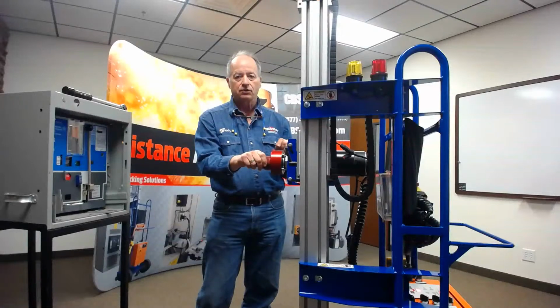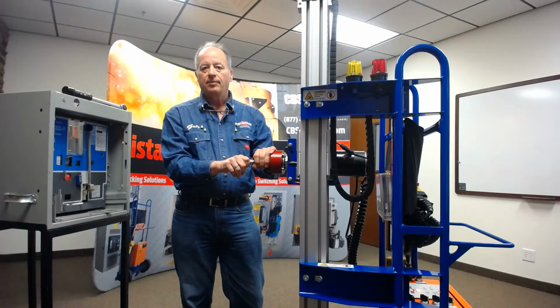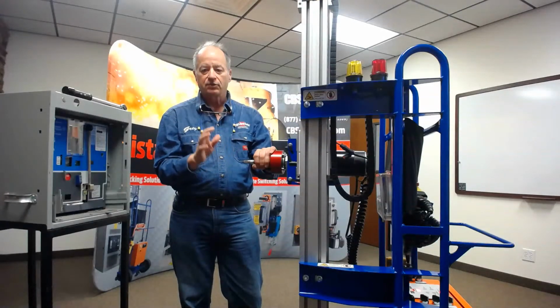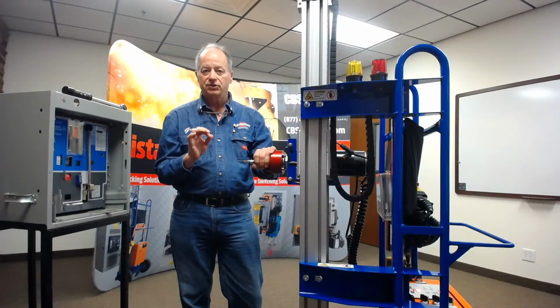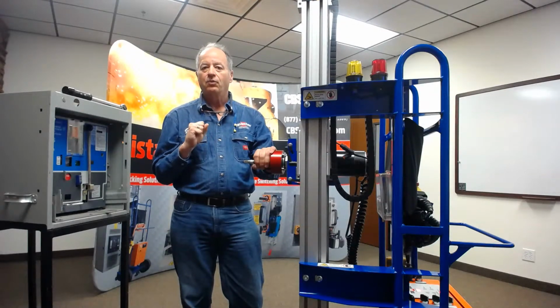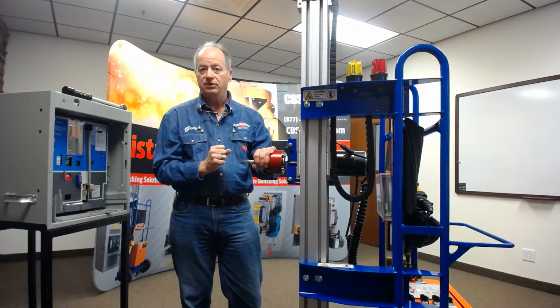The radio remote, again, is a great option for people who have high arc flash hazard boundaries. Even though this has been around for many years, I would make sure that people look at the arc flash hazard stickers and respect them, because I have been in many places, both domestically and internationally, where people just want to stand in front of the breakers and watch how things work as a natural human tendency. And you have to walk people back and walk off the distance of that arc flash hazard boundary to keep your people safe.